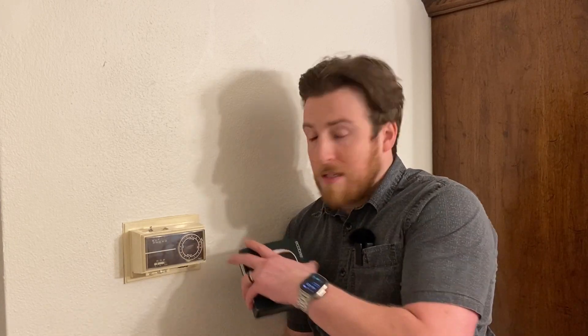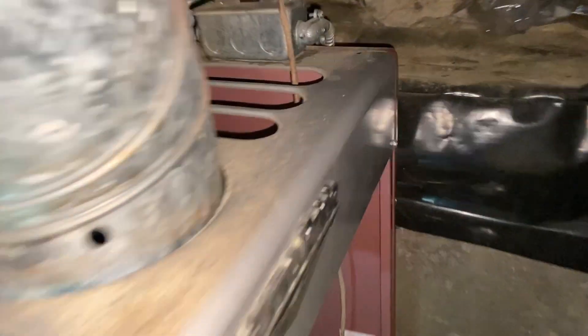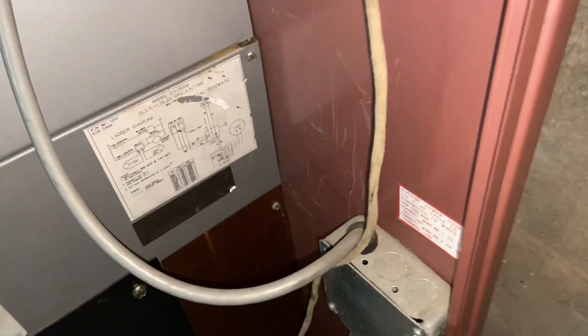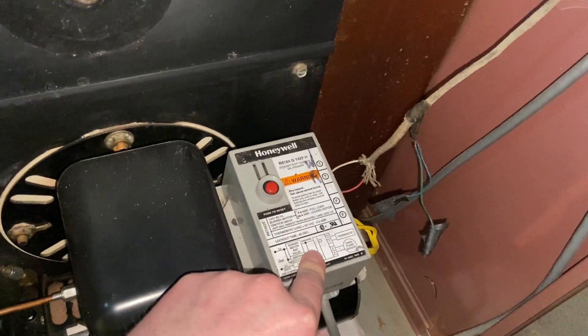Because I don't know what's behind here, I got the back plate just in case we need it. Here's the trusty ThermoPride oil furnace. We've got our 115V coming in through here to the switch, then down to this junction box. From the junction box, the one we care about goes this way and comes to this controller.